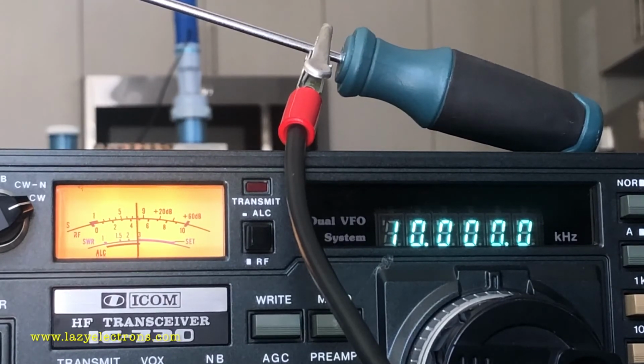Now, since it's the 10th harmonic, the signal strength is going to be pretty weak. That's where we are using a cable connected from the 180A to an antenna, which is a screwdriver that you see on top of the receiver. And that is used to induce the signal from the 180A into the receiver. And you can see how the zero beating happens on the S meter.